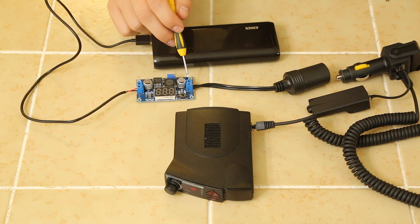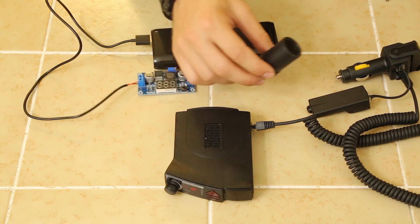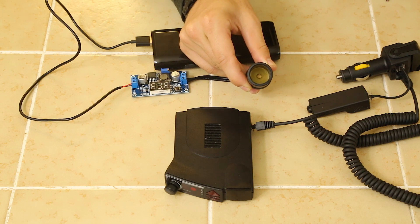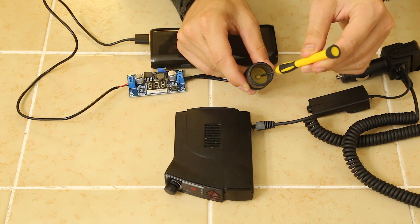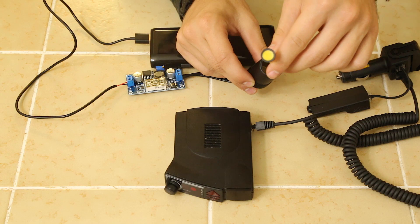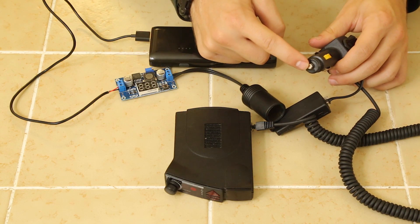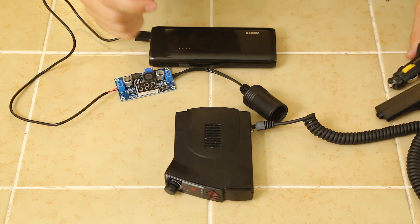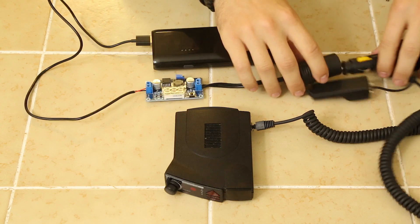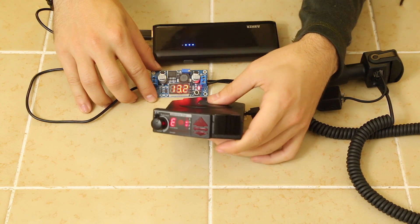Really simple. We've got our output power and ground wired up here. Just check it with a multimeter — I happen to have an extra one of these. They're super handy for random tests. If you guys haven't used it before, if you take a look at the middle, that little round thing right there is your power, and the ground is the outer sheath right here. So if you're testing with the multimeter, that's your ground on the outside and your power is right there in the plug. Just verify that with the multimeter. Once you get it all wired up, just plug it in, turn on your USB battery pack, and your detector fires right up.